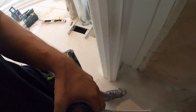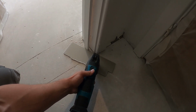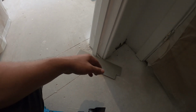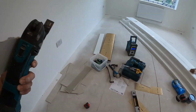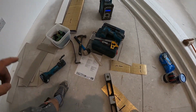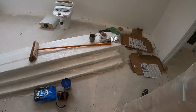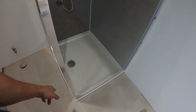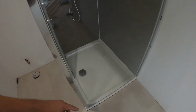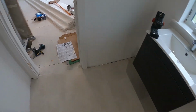All you've got to do is sit down and it's straightforward. You put your underlay down, then you get your thick flooring and cut it along, cut it off, and that will give you a perfect gap from the floor to the architrave. It's quite simple. Also, don't forget to have sharp blades. And lastly, you're going to need packers. You need basically 8 millimeters all the way around for expansion, and that should be plenty. Here we've got less, because we're going to put that rubber in, and that should sort it out. But everywhere else, we try to get around an 8mm gap, and that should be enough. Unless of course you get a leak, then nothing will help really.